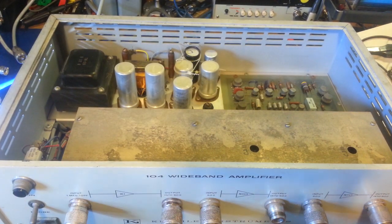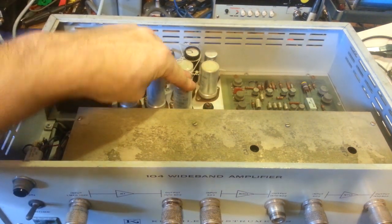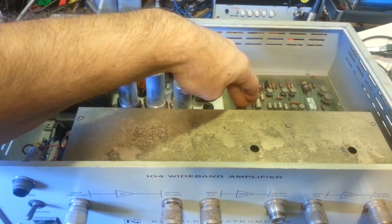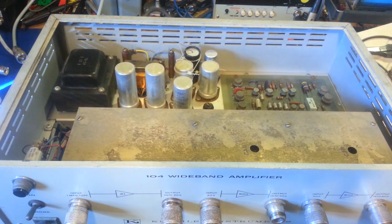It is noisy - oh my god, does this thing ever sing. I haven't even looked at the schematic - I just brought it up slowly on a Variac and didn't really have any current, and then all of a sudden bam - this high-pitched noise. I quickly hit the power switch. It almost sounded like - it didn't sound like a capacitor leaking, it was electrical noise. So I'll turn it on so you can hear it. It even sounds like it winds up and just steadily sits there and hums along. I don't think it's the cap - it might be this voltage regulator transistor down here. I can get the most effect by touching stuff over here, so it's in this area.